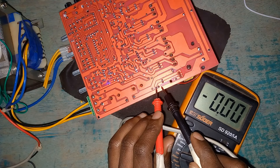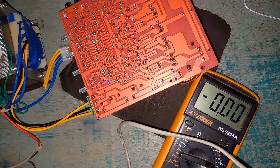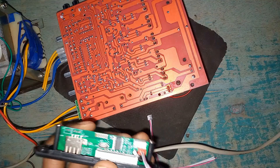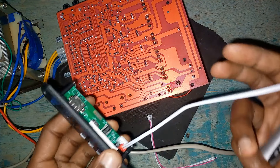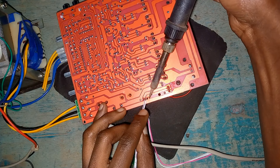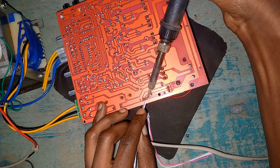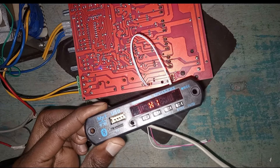Here is where I want to tap the Bluetooth device — that point is giving 11.8 volts, which is around 12 volts. These are the wires for powering the Bluetooth device. You can solder them and take note of where the positive and negative sides are, otherwise the device may get damaged.